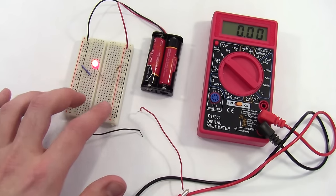Now I can put my multimeter in series. The LED went out when I broke the circuit, but once I put the multimeter in series the LED goes back on. I'm getting a pretty inaccurate reading of 0.01 at the 10-amp setting. It's safe now to move down to the port with the lower current range for a more accurate reading. Switching to the 200-milliamp setting, I'm getting a more accurate reading of about 13.7 to 13.8 milliamps. Just like with voltage, I can keep stepping down for more accuracy.